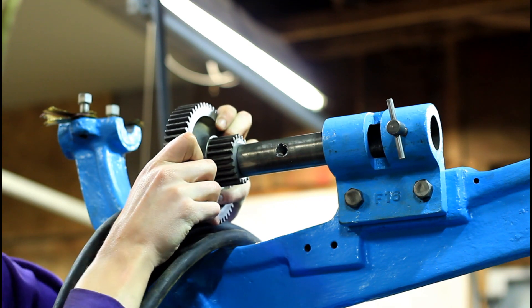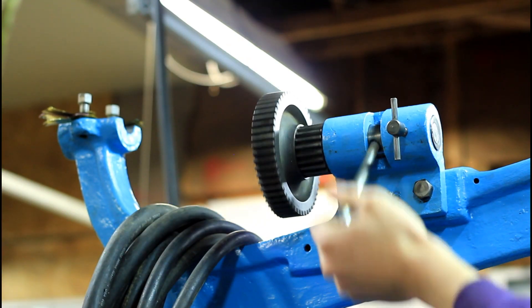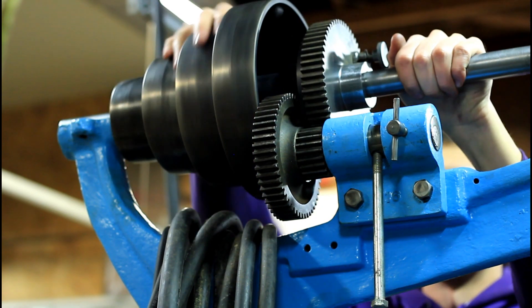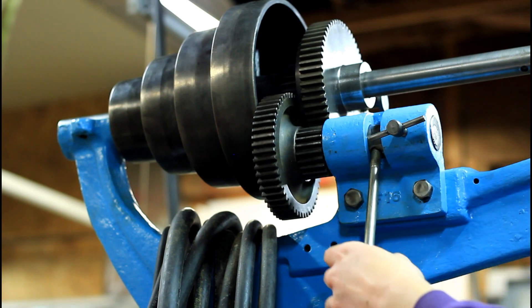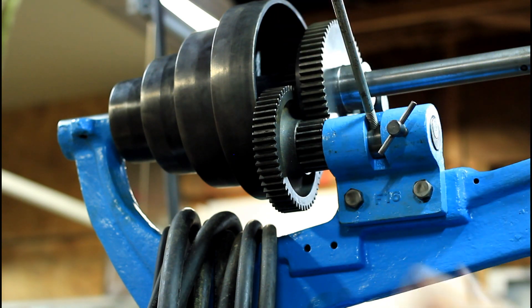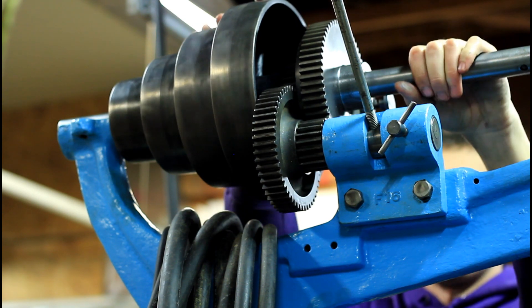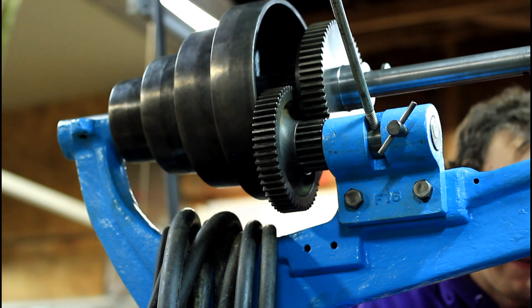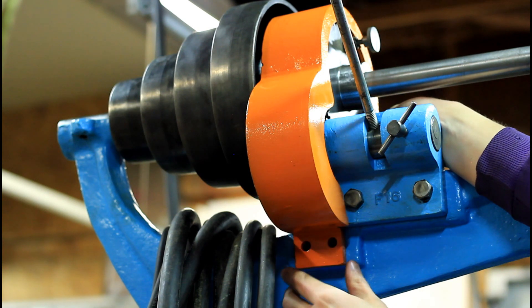I was about ready to test out the back gear mechanism for the first time ever — I was pretty excited to see it all coming together. Currently these are decoupled, but you turn this pin, turn the drive pulley, and engage back here. Then everything becomes locked — now nothing turns. You then pull this pin, and now we're in back gear. That's right about five and three quarter to one. I tried out the guard to see how everything was looking, which in my opinion is looking pretty good.